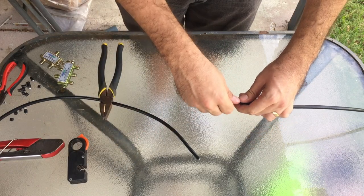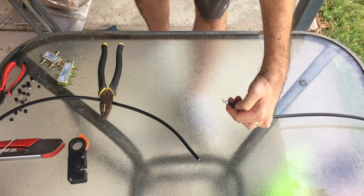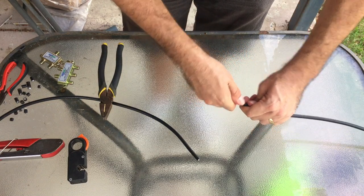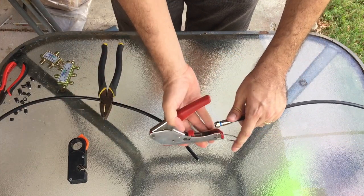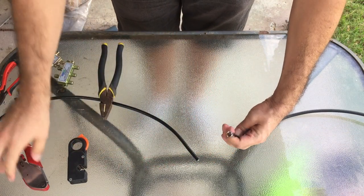I'm using a rotary stripper here — I'll show in another video exactly how to use these and how to terminate a cable with an F-connector. I'm using a compression F-connector here. As always, check to make sure the braid is not touching the centre conductor, and then terminate the cable. Again, make sure there's nothing touching the centre.